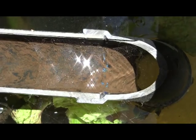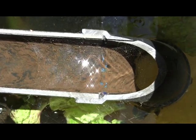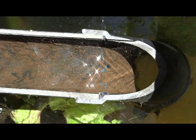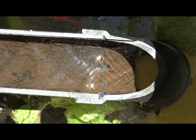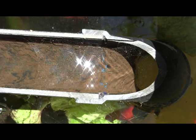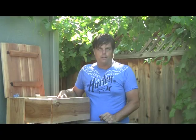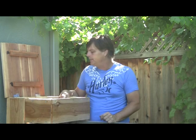Here's a water return, and you can see the actual water return. The pipe is opened so that the water comes up, goes around, and slips into the tank itself. That prevents water from dripping and making a lot of watering noises, because then you have to end up going to the bathroom all the time, or you can't sleep at night because you hear this thing going constantly. So I opened it up so that the water just slips into the tank.